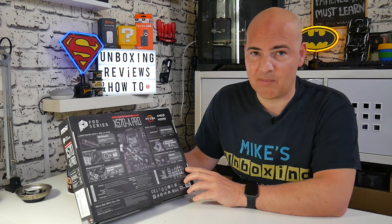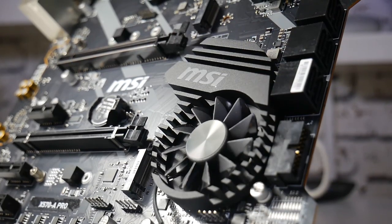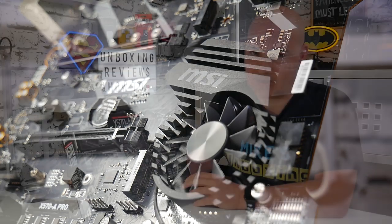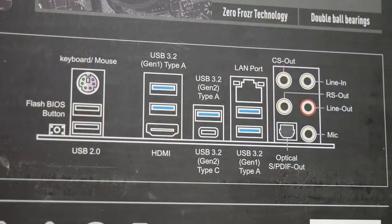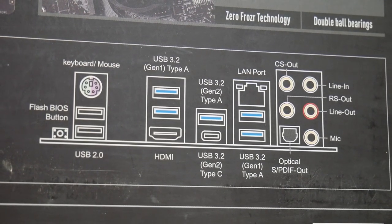One nice feature that stands out above the crowd is the chipset heatsink, which actually has a fan using the Frozr design and also supports zero RPM. If the fan doesn't need to spin because the chipset is cool in a well-aired chassis, it will actually stop — quite a rarity, as most X570 boards have fans that spin continually. That is a very nice feature. The rear I/O is also pretty decent for the spec, and we'll take a closer look during the board tour.